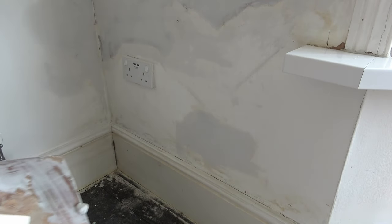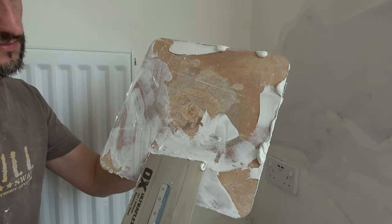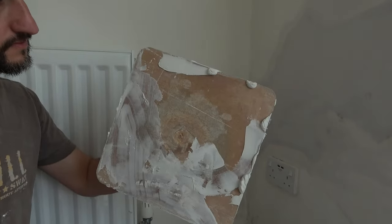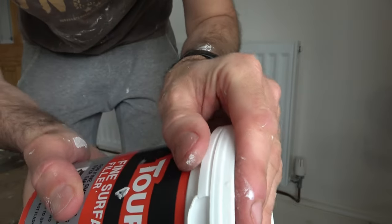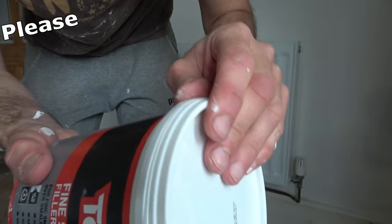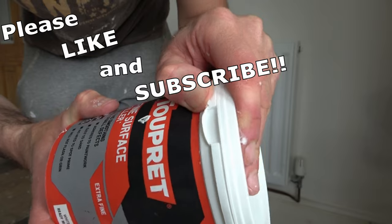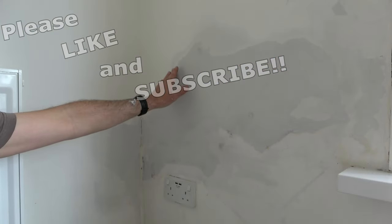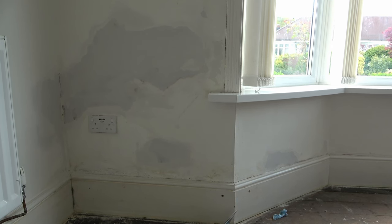Here you can see the advantage of using a larger trowel. If you notice your filler is going a bit hard and crusty on your tools, go and give them a wash and continue with clean tools. I've actually finished now so it's time to put the lid back on my filler. A quick tip: if you don't want your filler to go off inside your tub it needs to be sealed correctly — just ensure the lid is pushed right down. You might think it's closed and it's not, so just make sure you give it a really good squeeze. I'm happy now it's nice and flat and smooth. Now we just need to leave it to dry.